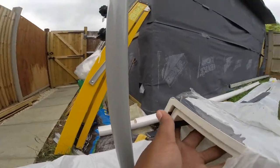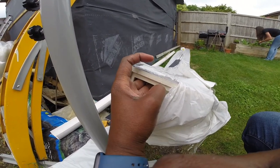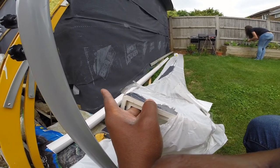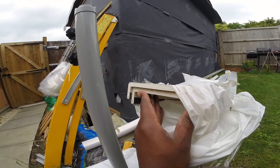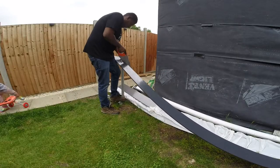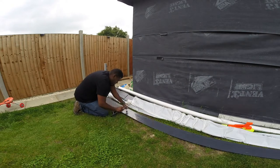What we've got here is some reveal liners, also known as fascias — soffit and fascias to go up there. Effectively, what reveal liners are: they're more slimline and they're designed to cap over timber frame. Whereas fascias are more of a final finish and framing. This is more of a thinner profile — it's just an L shape, whereas a fascia is a lot thicker. These are called liners effectively. This is about a centimetre, whereas fascias are normally about two centimetres. They're used not structurally but as more of a final finish. So if you don't have a timber going straight across, you'd use a fascia. Whereas we do in this case, so we're using a reveal liner. That is the difference between a fascia and a reveal liner.